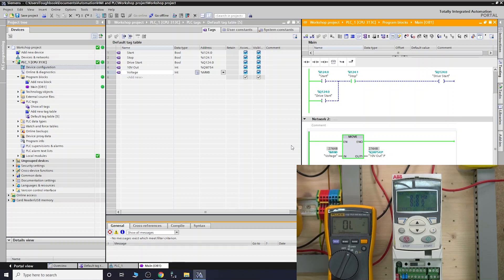Let me shut this off - that will do for this video. Hopefully it gives you a good understanding of how analog outputs work for this particular PLC, the CPU 313C. For analog output cards, the principle is very much the same - the only difference is you'll need to power the card itself, which you can find in the manual linked in the description. Just type in your card number and search for the PDF to find all the wiring information. Thank you very much for watching - if you enjoyed the video please like it, and if you're new to the channel please subscribe. I'll see you in the next video.